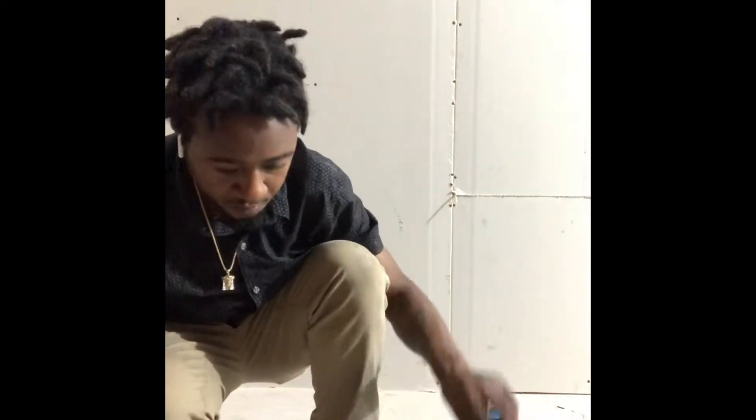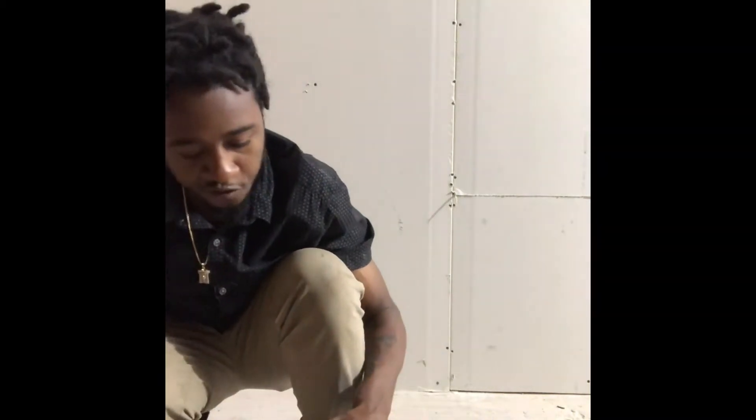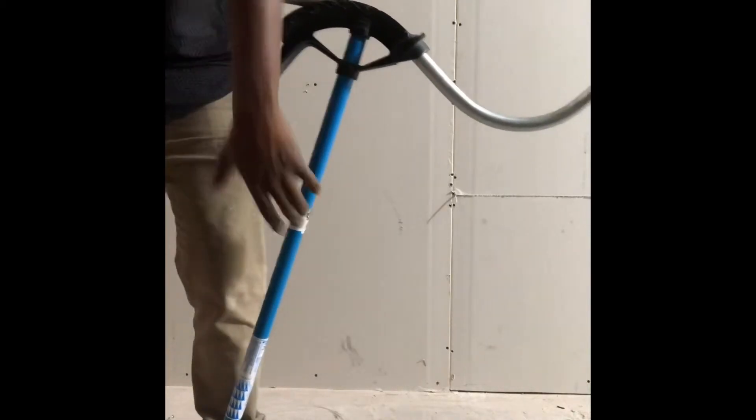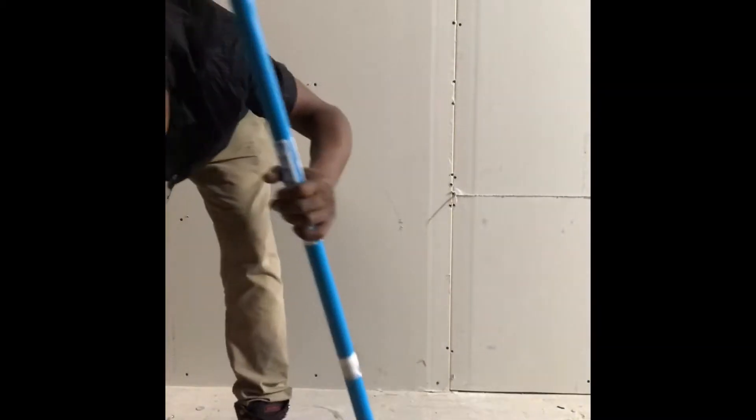The reason you take away three inches is because you want the next 90 to be 15 inches in between the bends. Place the pipe from that arm and put it on the star of the bender. Once you're on the star and nice and straight, you can begin the second bend. I like to bend it a little in the air, then finish on the floor so the pipe doesn't kick or move off my mark, since it's already half bent and will stay put.